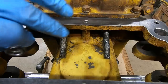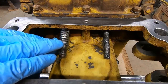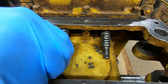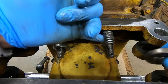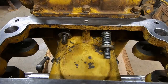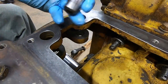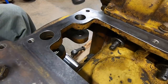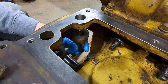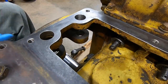To start with, we'll put the springs and the washers on the pull rods. Each pull rod is covered in grease — I like to even coat the springs and the washers with grease, as these things are in a pretty harsh environment. We start by putting the springs on, then the washers. Now I want to show you how the pins fit — they have a step with a smaller diameter on the bottom. Coming in from the top, they are a light press fit in the upper bore, but that step goes in the lower bore as a slip fit. You just drive these down until that shoulder hits the lower bore and they're fully installed. When everything is really clean, these tap in without a lot of trouble.